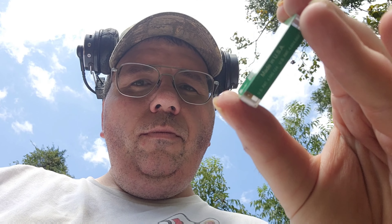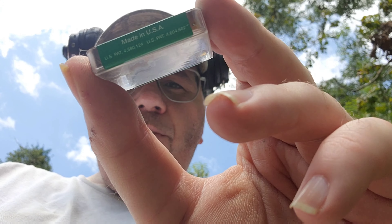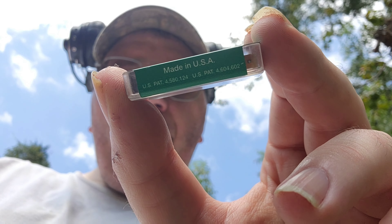So we got the tractor fixed, cranked back up. What it was — a fuse box messed up. Had to unplug it and plug it back in. We also went by B&H Parts Company and got some extra bus fuses from Mr. Gary and Mr. Keith. These fuses are made in the USA — 5 amp fuses. So it's running now, let's go do some more bush hogging. We'll see you later, be right back.